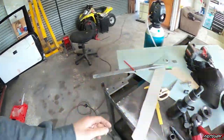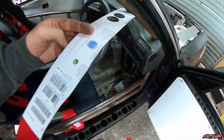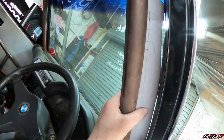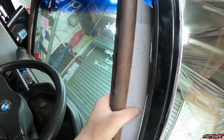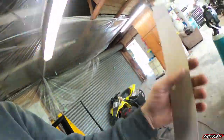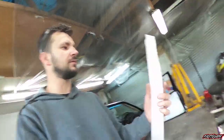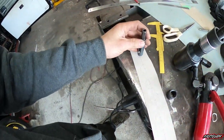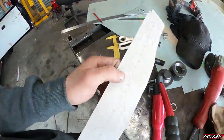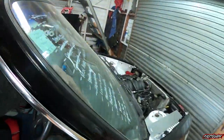After some pondering and accumulation, here's what I've come up with. It'll sit about there and I'll mark where all my hole centers are. I'm going to cut two of these out - the other side fits pretty much exactly the same, so the lateral bars must have been pretty close when I welded them in, which is good. I'll run the hole saw through first because that's the side of the thread for the punch, then punch and dimple die them. It is going to get a bit tricky in here trying to weld with the windscreen in, but we'll figure it out.